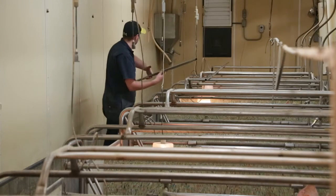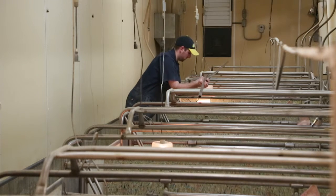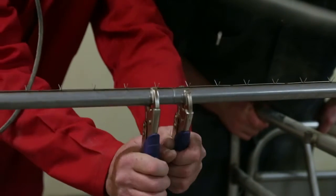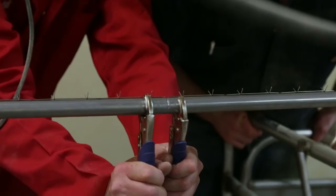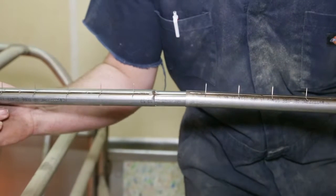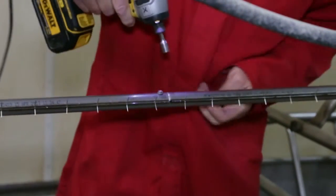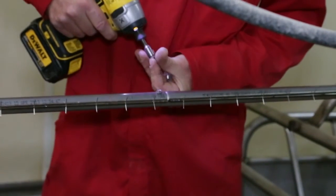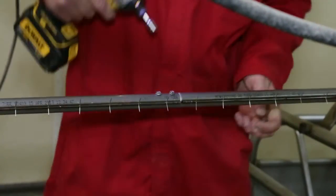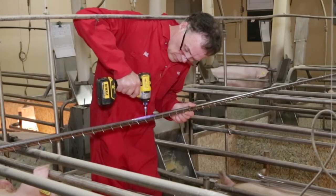Bring the corona pipe into the room female side first and assemble it from the far side of the room, below the support installed on the ceiling. The corona points are sharp — wear protective gloves if desired. The corona points on the pipe must be perfectly aligned in a straight line. The swedge joints must be pushed together to the maximum. Each swedge joint must have two self-tapping screws for maximum rigidity. If needed, use a small punch to make two small dents into the pipe at the location of the self-tapping screws; the dents will help guide the screws. Take care not to bend or damage the corona points welded to the pipes.